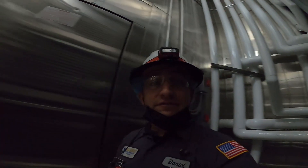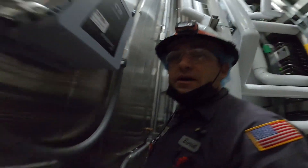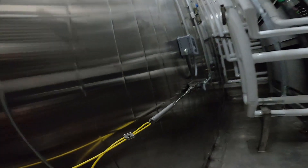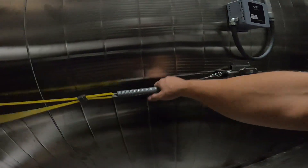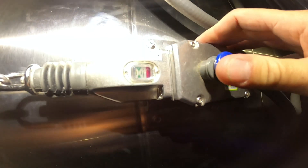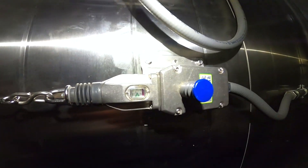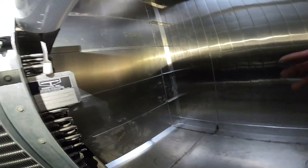It's going to be kind of hard to change the fans out if they fail, but we'll probably do that from the other side. Back here, if you get stuck in here, you can also stop the spiral freezer from this side — make sure these are reset. You pop these and it turns red, and then that resets it. There's some extra space here and the coil already has a nice drain line with heaters.